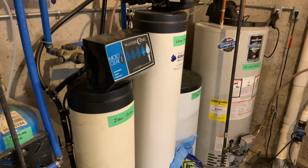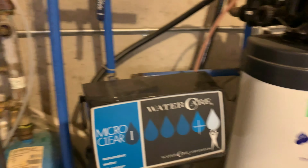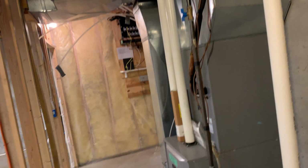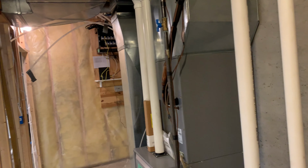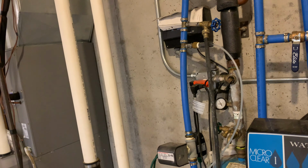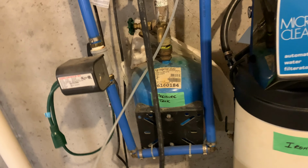The other wet systems in the house. Well, the well for the house is out in the front of the house, right where the front sidewalk splits in two. You'll find the wellhead. The pump is one of these continuously running pumps, which lets us use a much smaller pressure tank, so that's why this pressure tank is so small.